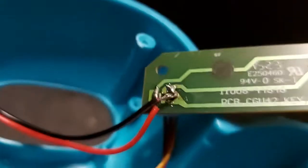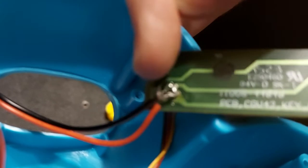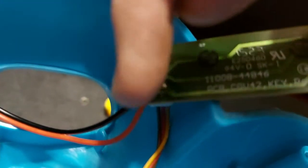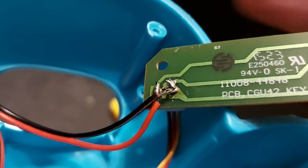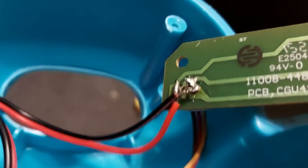Basically what's happening here is that there are two different solder connection points. One is coming in from this green line on the outside that goes to a solder point, and one comes from the upper part down to the outside. There are actually three points in there — there's one between them that you can't really see. You have to be careful to solder to the outside two points without joining them together, which can be tricky since they're quite small.